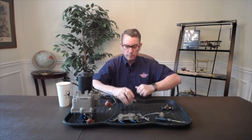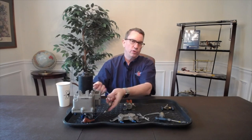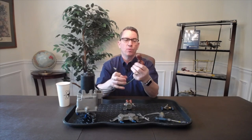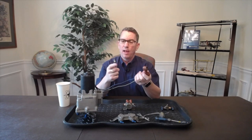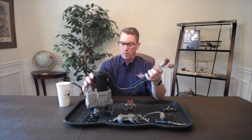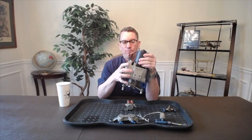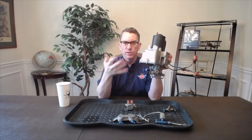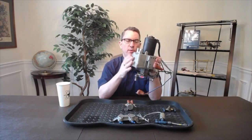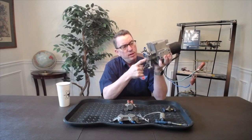So this is called the solenoid or contactor. From the gear switch we go to the solenoid, and now we're at the pump. This is also called a hydraulic power pack. It has three distinct colored wires: blue, green, and black. Green and blue are the power cables, and black goes to earth ground or is tied into the airframe. The pump is a medium-sized object mounted in the back portion of the Seminole, behind the cargo door and cargo partition.